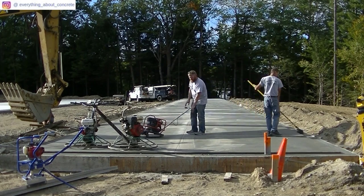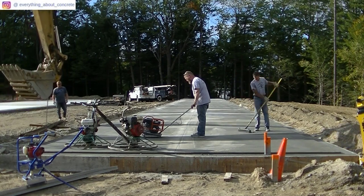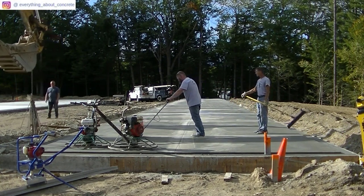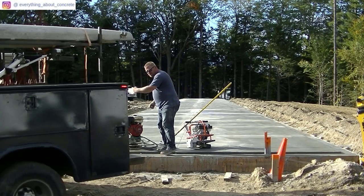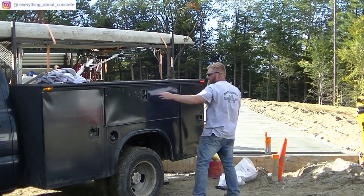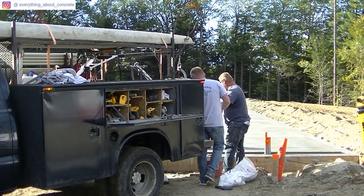The guys who did the gravel did a really good job grading and compacting, so there wasn't much digging we had to do under the forms. They have a really good laser they use. To get these laid out, the excavator had a guy come in with a satellite receiver — he just punches in the coordinates on the corners and it tells him right where to put the pins. We had him go every 50 feet and give exact coordinates. Now we're backing the truck in, we've got a crane on the back, lifting the power trowel up, getting it all cleaned and in the truck. That's how we finish and saw one of these. Thanks for watching, see you on the next video.